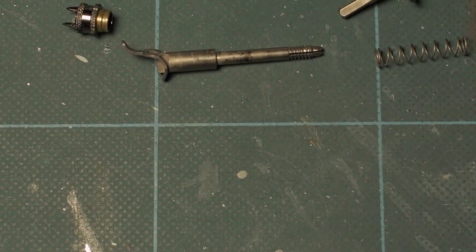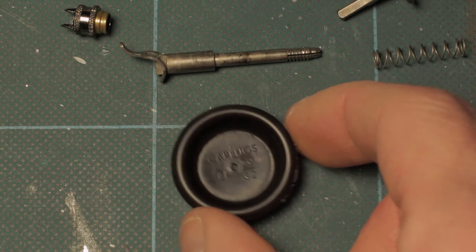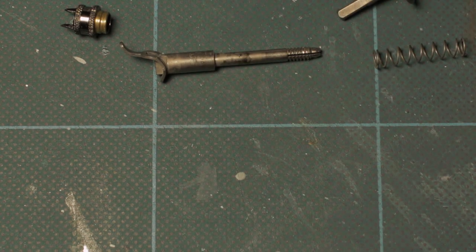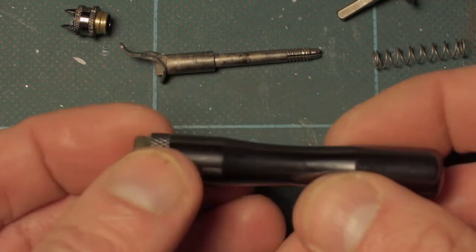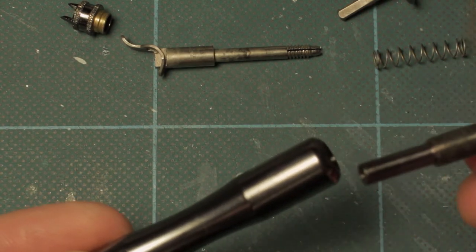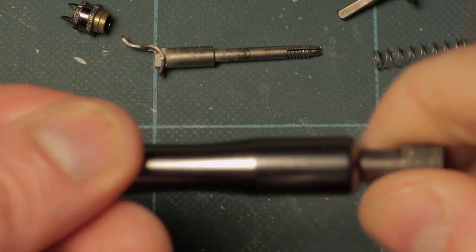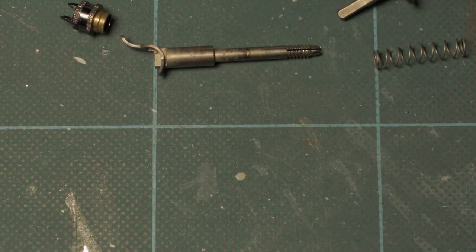The plastic cap is just a plastic plug - it does the job but I don't think it looks particularly good for an expensive airbrush. What I do like is the cutaway on the handle, which naturally sits over your thumb when it's in your hand - I'll demonstrate once I've put it back together. Then there's the little adjuster at the back, which has a rubber O-ring and allows you to wind the needle stop in and out for spraying very fine lines.